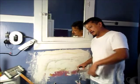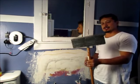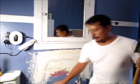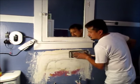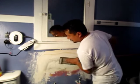I had a sponge sander on hand. When I change rims out I use sponge sanders to clean around the rim. If you've got a big area to sand, these drywall sanders are really good — it's like a screen on here, not sandpaper. Don't use your regular hands because it's not going to come out as smooth. It's not too much area here — all I'm trying to do is knock it down so I can put another coat. This is going to be my second coat.